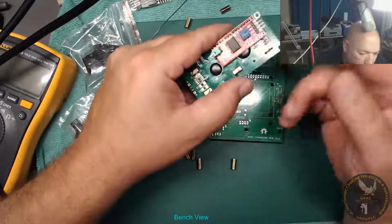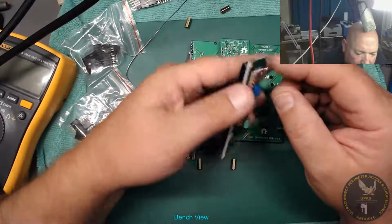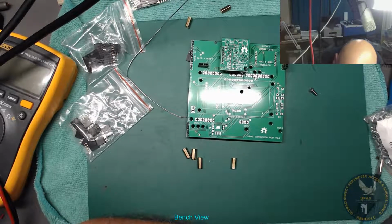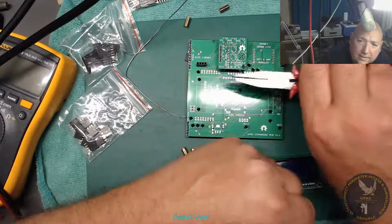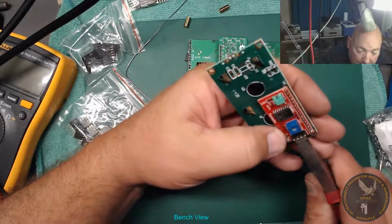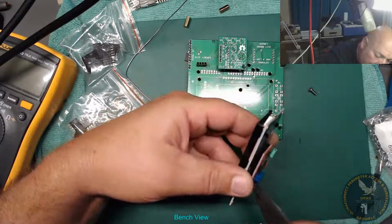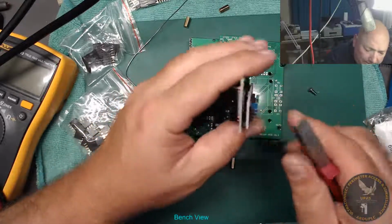Now with this, I have to straighten them. These I2C adapters come with them bent, so I need to fold them back. So where is the? Yes, I've got a nice little tool for that. Here it is. Nice little tool. It's just a flat-ended. So basically, I'm gonna grab it like that. Grab all pins. I don't know if I can grab them all together. No, I'm gonna have to do 3 at a time, or I'll do 2 at a time. So hold it like that and just straighten them up. Now they're all up. I can just straighten them a bit.